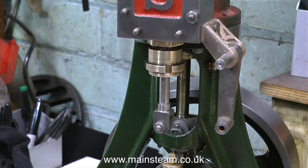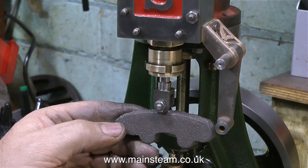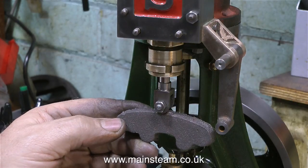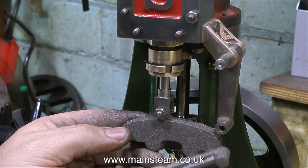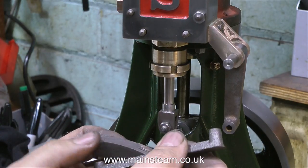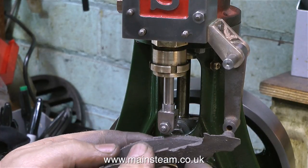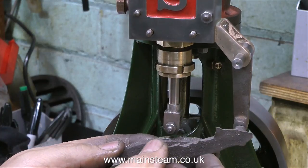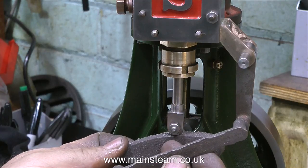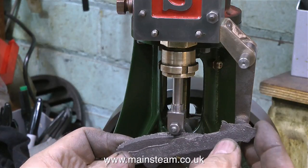There's still quite a long way to go, but I'm getting there slowly but surely. This is the casting for the expansion link — not much to go on really, it's just a lump of cast iron and it needs machining. It needs a slot milling in it, a curved slot — a piece of proper engineering. Making these is going to be a lot of filing and grinding and messing about. Really I could fabricate these out of mild steel, but in this case I'm not taking the easy option. Rough as they are, I'm going to use these castings, clean them up, and make it all work with the parts that came with the kit that I got from Stuart Models.